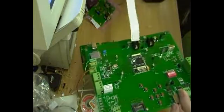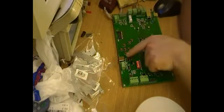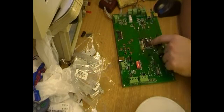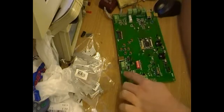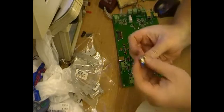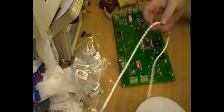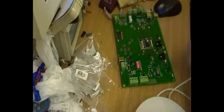Or if you really want to, you can leave it off the board. On the board I've got an option for USB to serial into the GHI Embedded Master, and there's a jumper header so you can also use straight RS-232 if you want. For the three boards, I'm going to make up three DB9 cables into the connector.